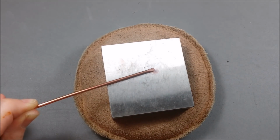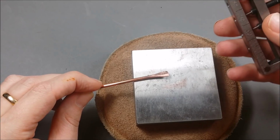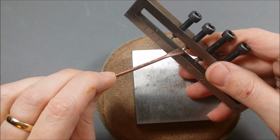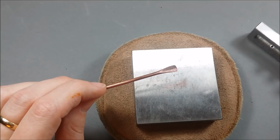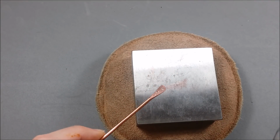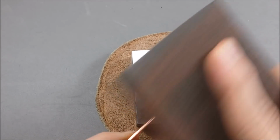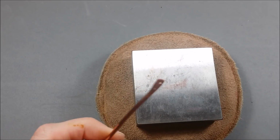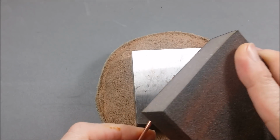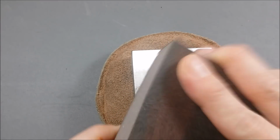The heavy 6-ounce hammerhead really helps with these thicker wires. So I've got it nice and hammered flat. It needs to be able to accommodate 2 hole punches, at least, 5 millimeters apart from one another. Anytime I'm working with sheet metal or I'm hammering, I'm filing and sanding constantly because you just want those edges nice and smooth.